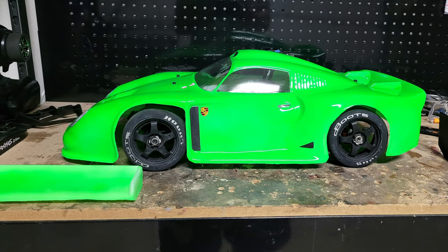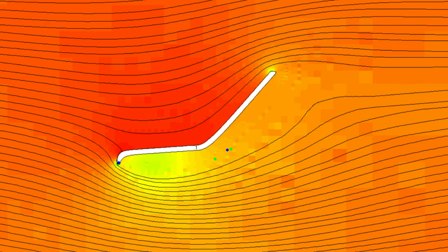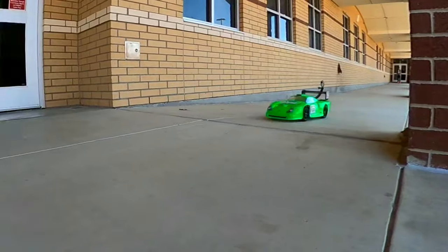As far as making custom wings with any process, it's always worth the time in my book, because the fake wings you usually see aren't just poor in terms of lift-to-drag ratio. That drag doesn't just sap top speed — it also diminishes the handling characteristics of the vehicle and makes it harder to balance the car, which is a topic I hope to cover a lot more as I add more aero to this car. Let me know what you think if it's something you're interested in, or if it's a little too much work.